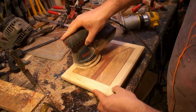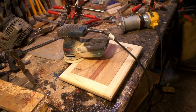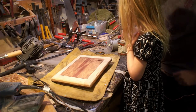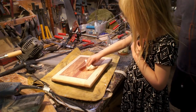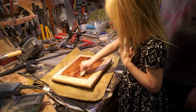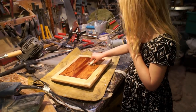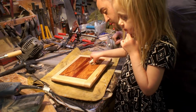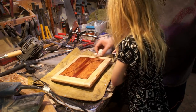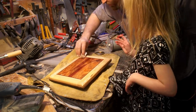I used a belt sander and then came up with the orbital through 80, 120, 220, 420, and I think I went all the way up to 600 grit. All the pain of the sanding is instantly forgotten when you start putting the finish on. For this one, since it's going to be in contact with food, I'm using a food-safe Watco butcher's block oil. It's a finish that after use you can do a quick sanding and reapply if you need to. In a couple of years since making this, we honestly haven't used it a whole lot but the finish has held up really well.